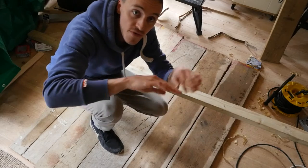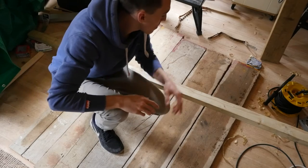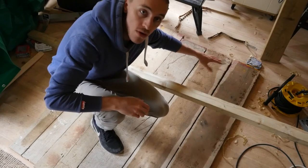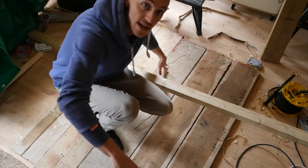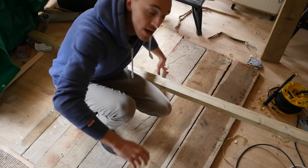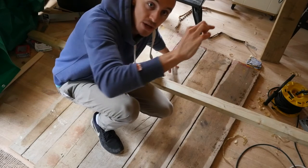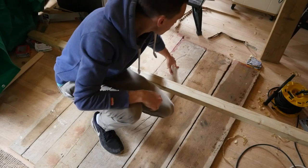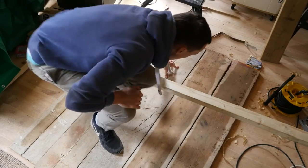So what I've done is I've removed the metal edgings that the ends of scaffolding boards usually have. If I keep them on one end and the cut end doesn't have any, then this side is going to be closer together and bunched up, and then further up here there are going to be small gaps appearing as it tapers up, so I don't want that. So I removed them all, and now they all go nice and flush.